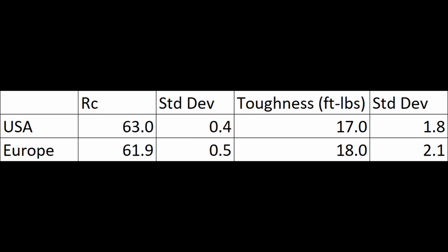The standard deviation in toughness was a little bit wider in the European version, meaning more variation between low and high results. But there is a trend where low-toughness steels have a small range — something with five foot-pounds might vary from 4.5 to 5.5 — while something at 50 foot-pounds might vary from 35 to 60. The range gets bigger, so I don't think this necessarily means anything. Basically, the steels were very similar apart from hardness, where the USA version ended up a little harder. There were no outlier coupons to drop and no evidence of large oxide particles leading to lower toughness.